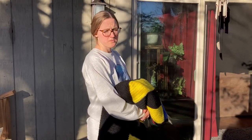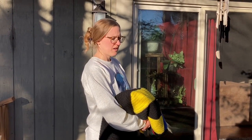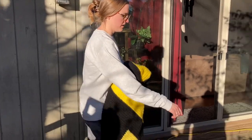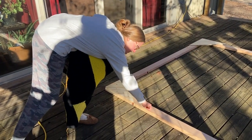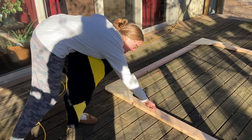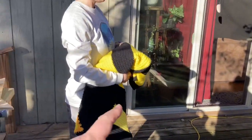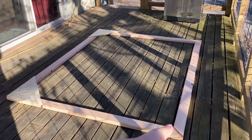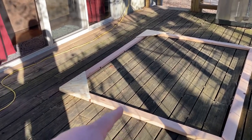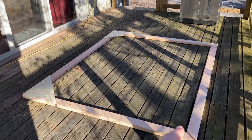We subtracted two inches from the inside, because I want the nails that I'm gonna tack the blanket down with to be right in the center of the two-by-four on the flat side. So we did the length and width and then from the inside measurement of the two-by-fours we took two inches off, so that the blanket would overlap.